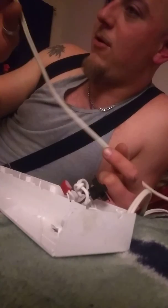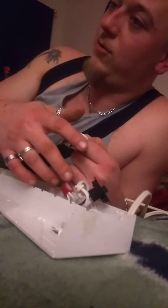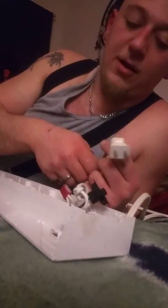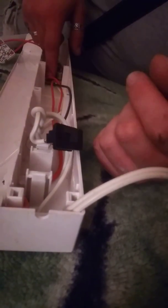So when you have your power source right here, negative, positive, or hot and neutral, in this case, because alternating current, follow it down. You see that the wire that is smooth connects to the switch. That's it. It just completes the circuit. So when you have it off, there's nothing connecting that wire to that wire. You turn it on, flip it over. Now those two wires are connected together. So now this is your hot line. This black one, as it comes out.